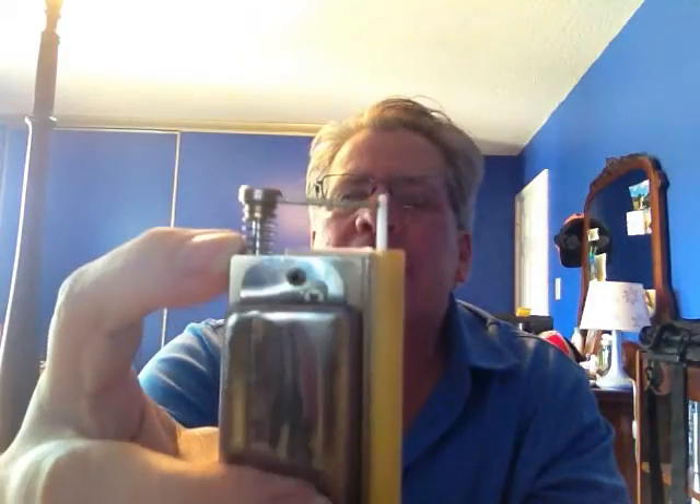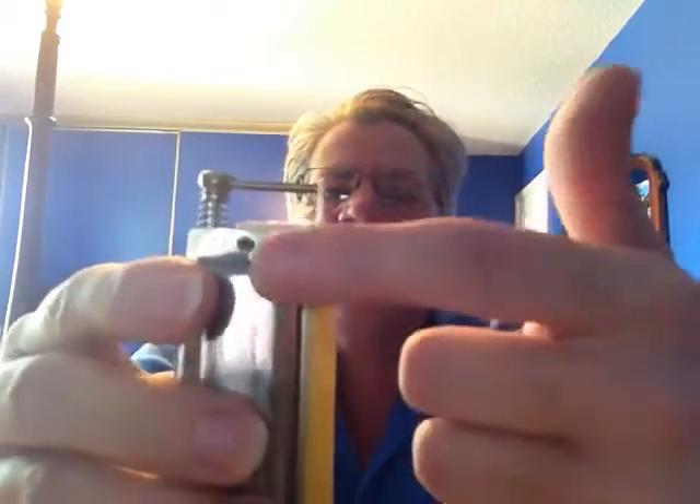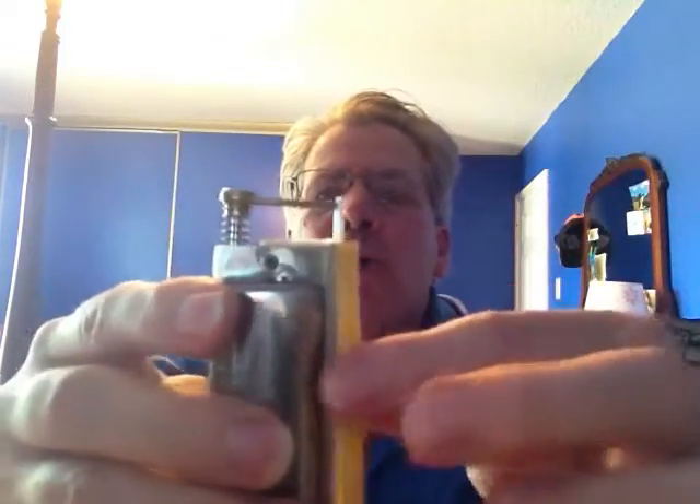I had to come up with a new button design. This button, if you notice, it has a piston underneath it to keep it straight and level. The traditional torsion spring used here in the comb, which would be about right here, it bowed this flexible mouthpiece out. I also tried a compression spring without a piston, and I had the same problem.